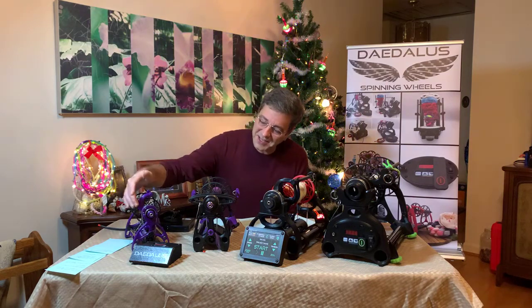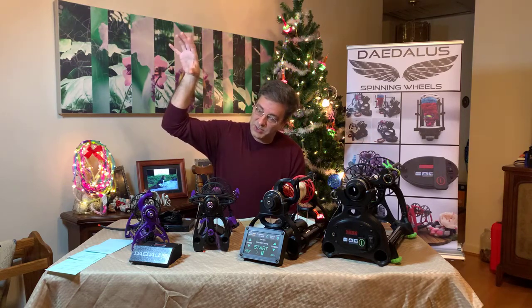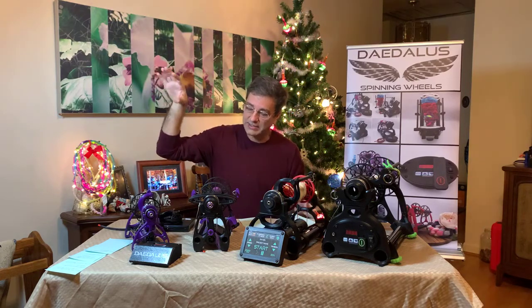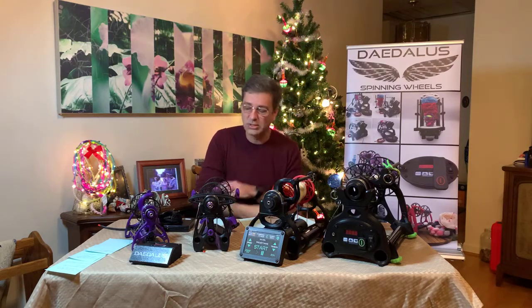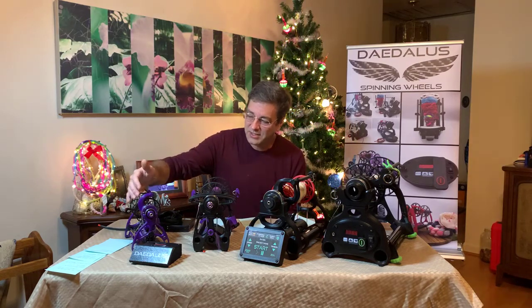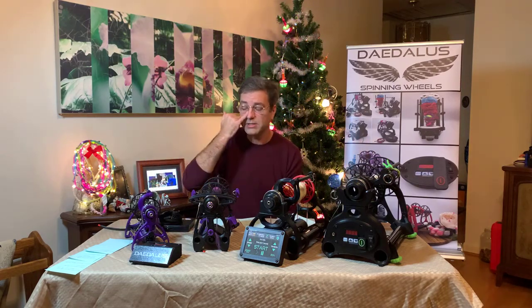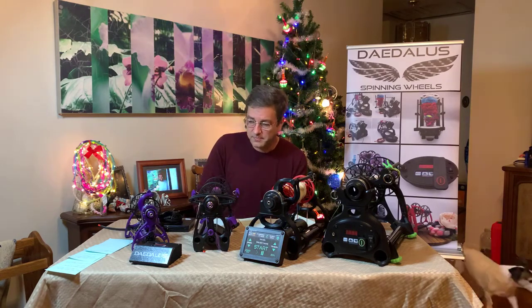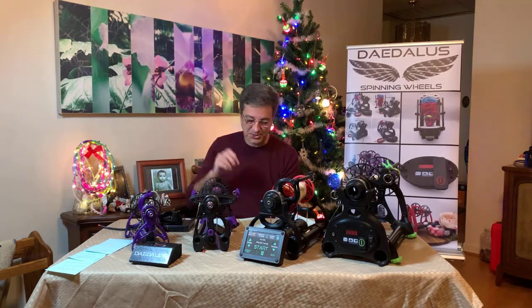But it's actually kind of aerodynamically nice, because if you're spinning something, if there's drag out at the end of it, it means more than if it's near the center. And so out at your flyer arms, that's where if you have a lot of drag, the motor's going to have to work harder to overcome that. And that's work that you can't use the motor for. So trying to minimize those drags is really important to me. And by sweeping that arm, it caused the outboard portion of it to be more in line with the airflow. And so, man, on the bench, it just tested out really cleanly. Doesn't throw a lot of air. And I think it's cute, too. I think it still has an organic feel, like it's not what an engineer would typically build.